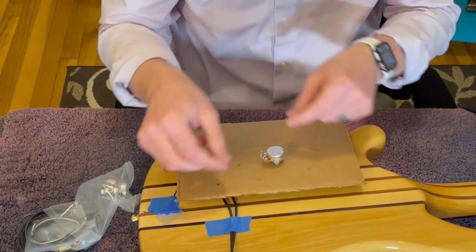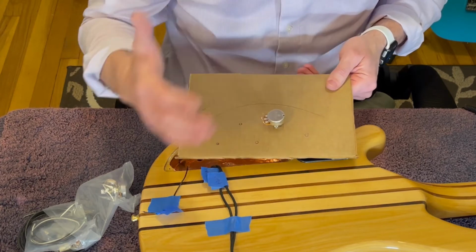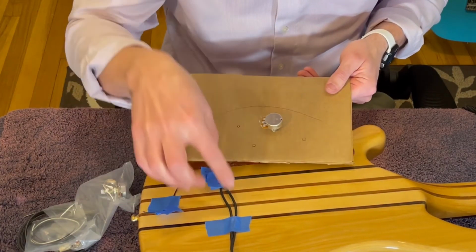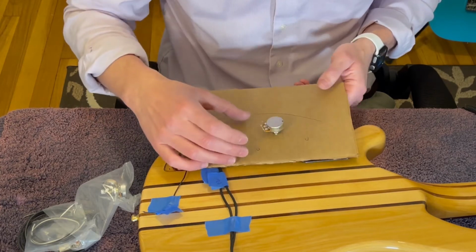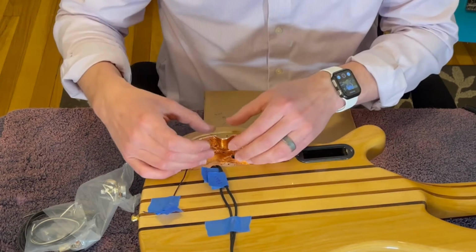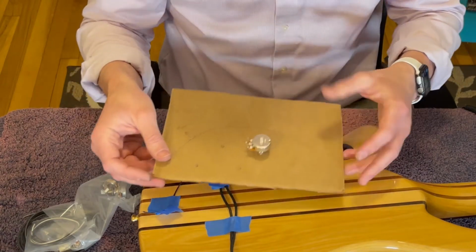and then I can be soldering here on the workbench outside of this cavity, because then when I just can't do anything else without the pickup wires or the ground wire, when it's time for those, everything is perfectly measured and soldered. I just pull them all out and then take the whole thing and just drop them in, and they will all fit in because we made this to scale. So that's the second tip.